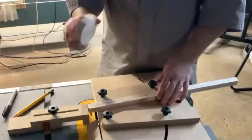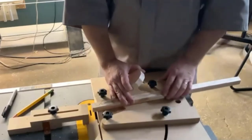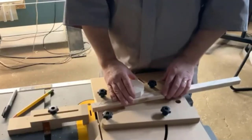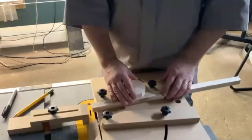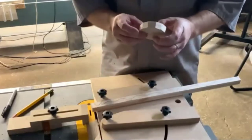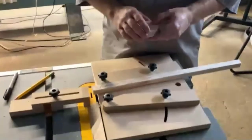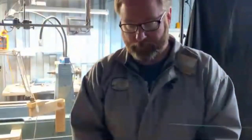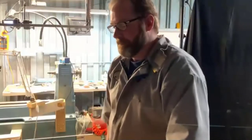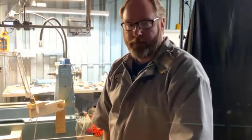Pete, now there are, yes. That's really not a preferred way to do a bottom solid like that, because over time those bottoms will break out. Now, because you are putting the plug in the bottom and drilling that out, you got the relief that you need. But I know many people that have made segmented vases using a wedge like that. Yes. And the change in humidity and stuff will bust that apart. So there's a whole thing about what's called floating a base inside of that ring and doing inserts to keep bowls and vases from breaking apart in 10, 15 years. Right.